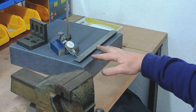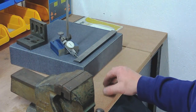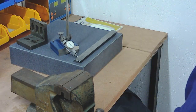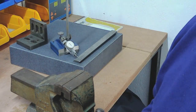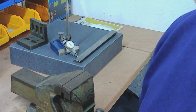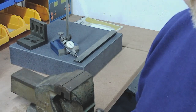I'll do the same with the X-axis stuff and try and film some of that as I go — more so the draw filing work and the assessment, because I think it's not a very common way. Typically you'll see people putting engineer's blue everywhere and scraping stuff in, which is the right way to do it, to be fair. This is a bit of a cowboy way — it's not quite as accurate, but certainly accurate enough compared to the rest of the mill that I'm building.